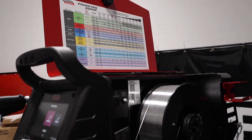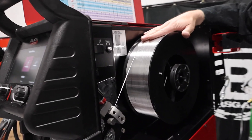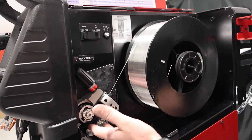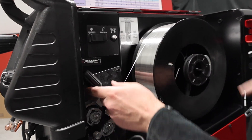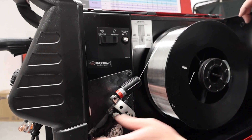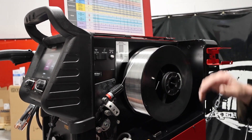On the inside of the unit we have our aluminum wire. I have some 5356, .035 wire in here — we're going to push it through the 10-foot gun. The unit came with .035 and .045 drive rolls, and in the kit I got .035 drive rolls, contact tips, and the guides. I set the wire tension at 2 for the aluminum. It's the standard Lincoln drive roll system — very robust, very well built. The guides are plastic for the aluminum so it flows better.